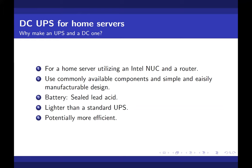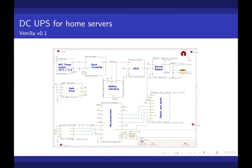As a power source we had the Intel NUC adapter in the top left corner, which gives 19 volts. Fortunately, this particular NUC could accept a wide range of voltages — 12 volts to 19 volts. The output of this UPS is 12 volts, which is close to the battery voltage. The battery voltage typically varies anywhere from about 10.4 volts to 14.4 volts. We then had a buck converter to step down the 19 volts to the battery's charging voltage.